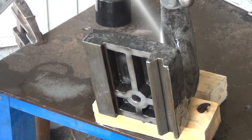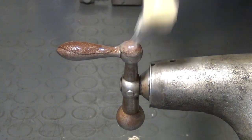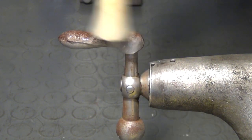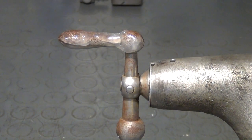However, I didn't use sandblasting on the moving parts of the tailstock — for that I used chemical means. Specifically, citric acid and a gelatinous rust remover that is also based on citric acid. And if you want to know more about that, I made a special episode about citric acid rust removal — you can find it in the video description.